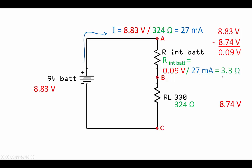Internal resistance doesn't just come from the battery — it also comes from the wires in the circuit. Wires are there to distribute current to the desired load, and they have very little resistance. But with very long wire, the longer the wire the more the resistance. So in cases like electrical wiring in a home or a business, if the stretches are very long, you're going to drop some of the voltage on those wires.